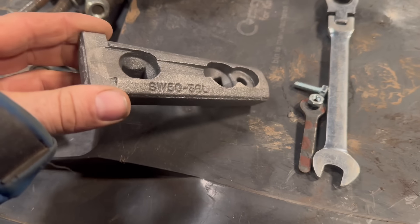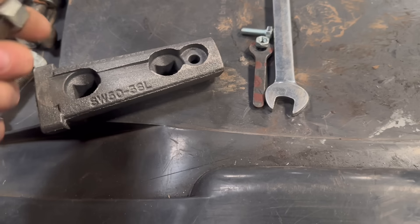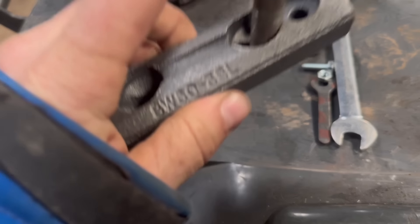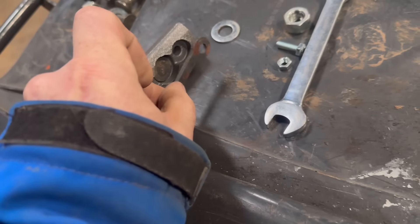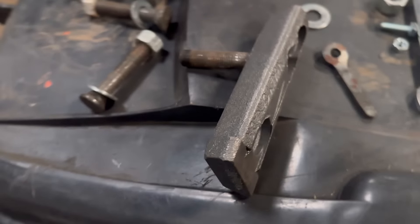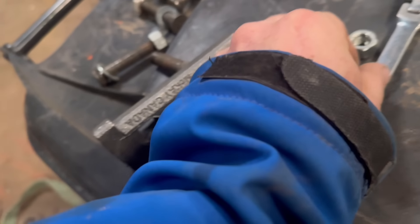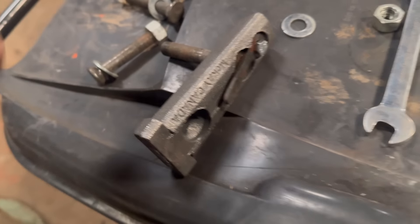Sunday morning. This is a different version of what holds the feet onto the cultivator. The other ones have a spring, but in this one I'm just going to build it up by putting that bolt in there so it'll square back to it. This little locking tab fastens onto there. The other ones have a spring inside and a little button, and the spring's been failing and the button's been sticking, letting the feet fall off.